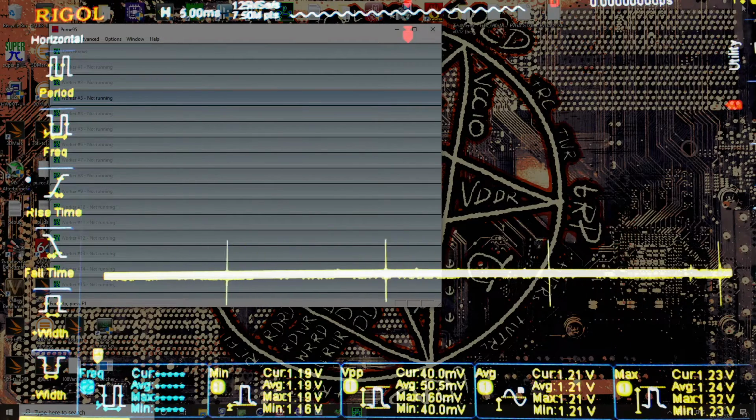because Intel provides a connection directly, like a voltage measurement connection that goes very, very close to the silicon. It might even go into the silicon. Basically Intel has a dedicated connection for controlling your voltage regulator. So that is why, if you measure from the back of the CPU socket, you're going to see the voltage go up if you have very, very aggressive LLC.